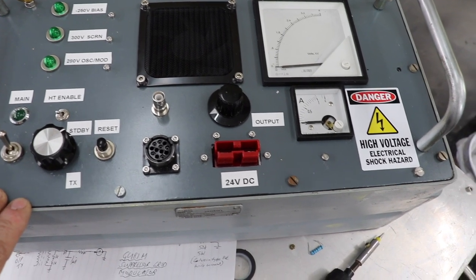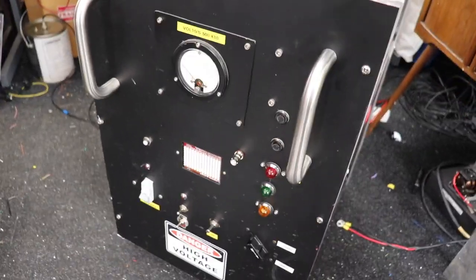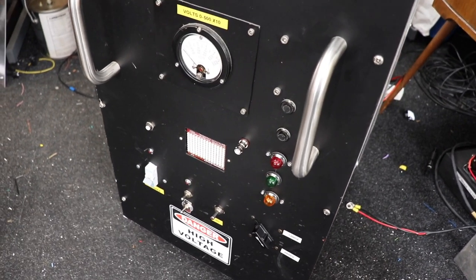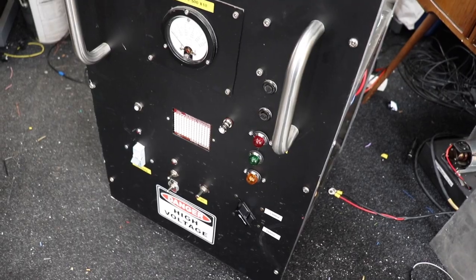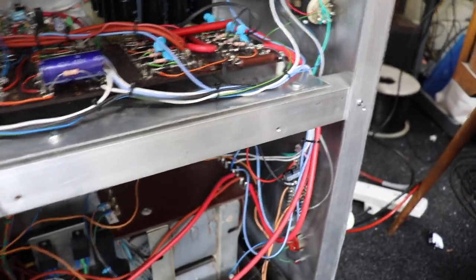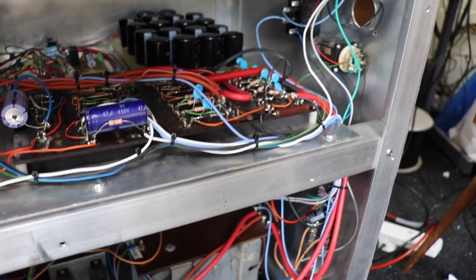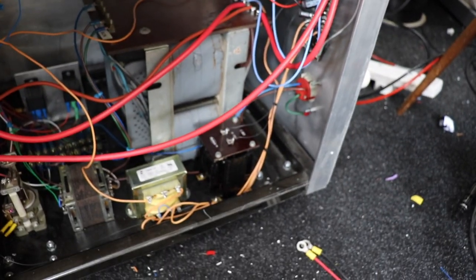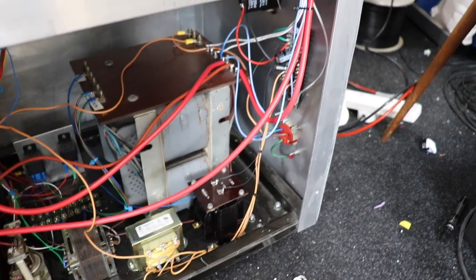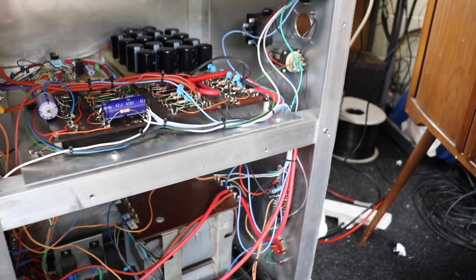back. So what we did to get this to work, I ended up using my old power supply, which was from my 813 linear amplifier, which I don't reuse much, and I'm going to probably rebuild into something else. So I've made a few modifications. This was on a video quite a long time ago when I first made this. Made this about 10 years ago actually now, so it's done pretty well. But I basically had a few transformers there, choke for the different voltages that I need for that GU81 transmitter.